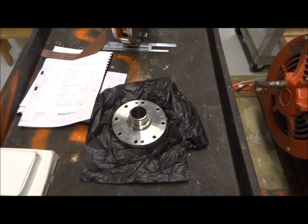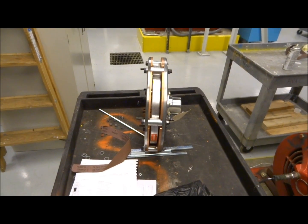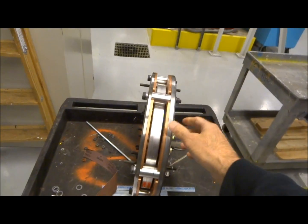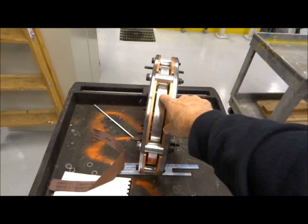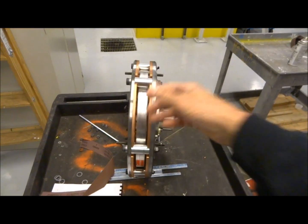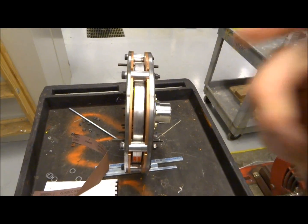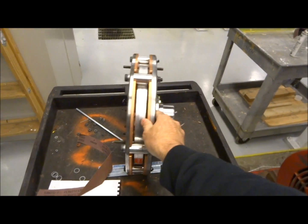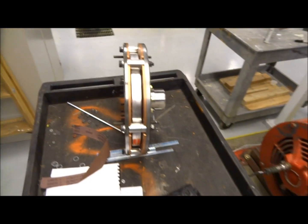The load hub has been removed, but you can see the coupling. The nice thing about these magnet drive couplings is there's no physical connection between the driver and the load. They've got this rotor here that's got very heavy, very strong permanent magnets, and then the outer part here is a conductor with these copper plates. The magnetic field created between the magnet rotor and the conductor causes the load side to spin.